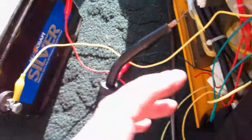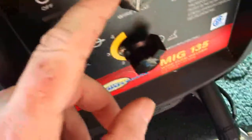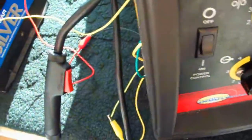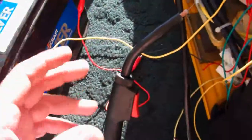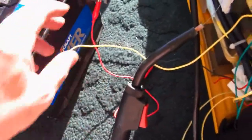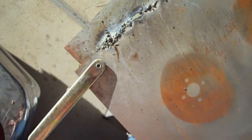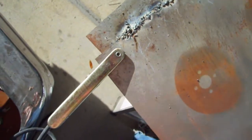So I can just set this up. If I get the right potentiometer, I could take a little battery — it doesn't have to be this big — make a wire that plugs into it, put a connector on the case and it welds. The only problem is I can't adjust the wire speed and you can see it's all splattery, but it's welding. Here I was burning through because I had it up too high and this is 22 gauge, but the stupid thing works.